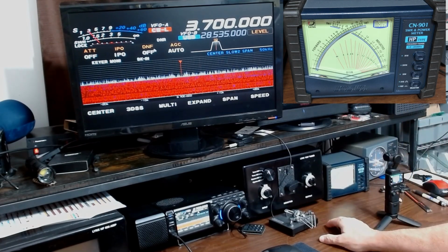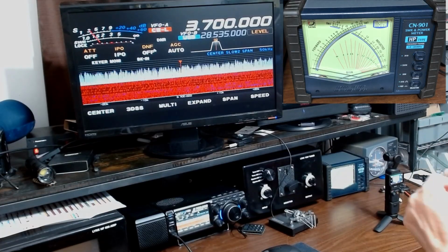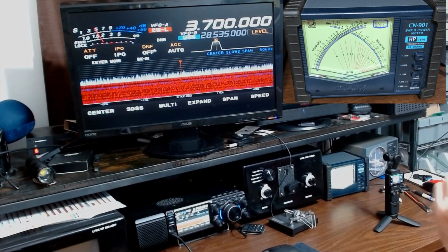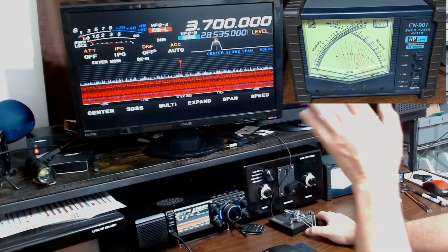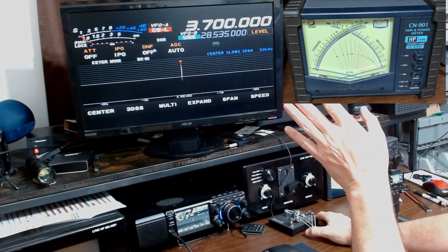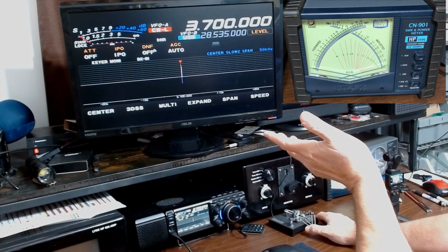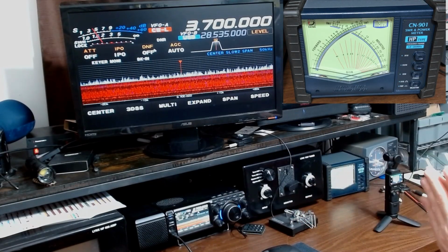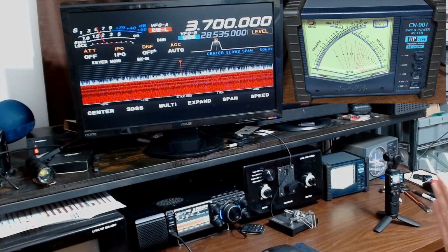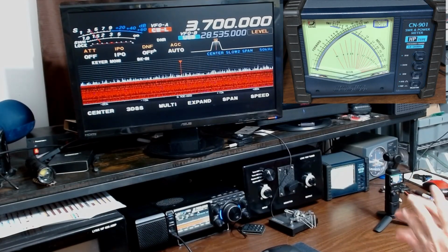We've tuned it, we've made those adjustments that some of you believe makes changes to the antenna, some of us don't think it changes the antenna. So let's see what we get on the Yaesu now. Pretty flat. Pretty much 1-to-1. I mean, it looks dead on 1-to-1. So now my radio sees a 1-to-1 match. It thinks my antenna is perfect. Now I would argue it doesn't know about the antenna, it's only seeing my antenna tuner.